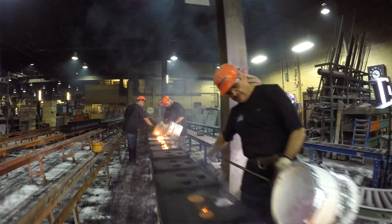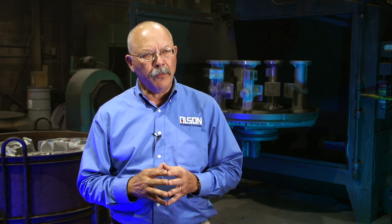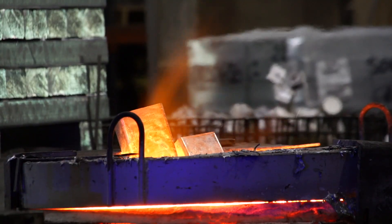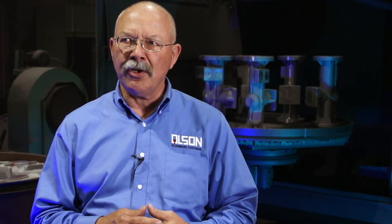We want to be the machinist's best friend. The machinists love that because they cut clean chips, they get better dimensional characteristics, and their tool life is actually better. We've had machine shop after machine shop come back and say you're casting machines like no others. There are other cases where you'd want metal integrity to be such that you have no voids, no pits — explosion-proof devices, anytime you have a flame path that you have to deal with after machining, you can't have so much as a ten-thousandths pit somewhere on the surface, as those will be detrimental and actually cause a failure.